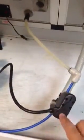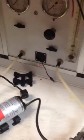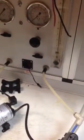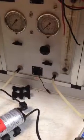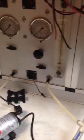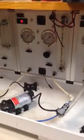with the benefit of a system that we show here, the pump connected to the switch with a about 12-inch hose, a little bit longer than one that you guys have, into the switch, out of the switch, into the system, with a small accumulator tank in the back, which is in our opinion the best way to smooth out the flow and give you, you'll see right now in this video, the difference of how with an accumulator tank you have a much steadier way of setting the switch. And it's a separate subject, but one we think is important.